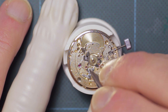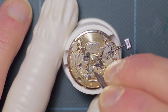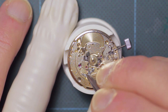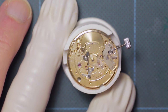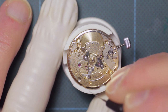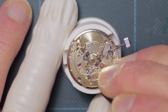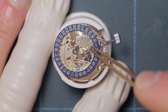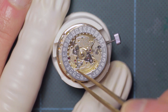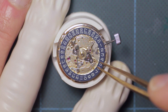There are several parts that make up this mechanism and it's quite a clever assembly. What it does is hold the day-date change mechanism under tension right until the very last second, where it snaps over both the day and the date in a fraction of a second to the following day. It will quite literally just snap both of them over at midnight so quickly that you'd barely even notice it. It's a very clever system but there are an awful lot of levers and bits and pieces.